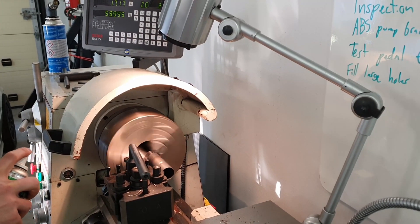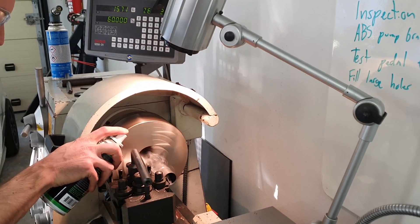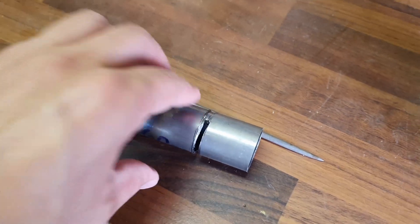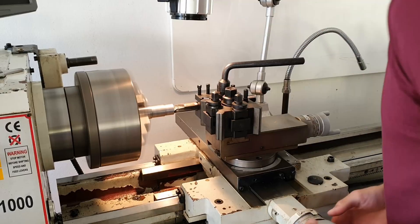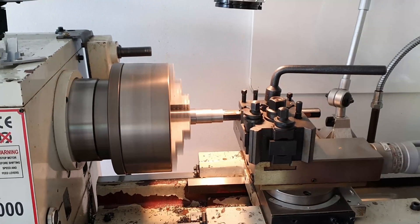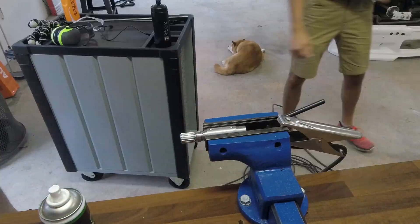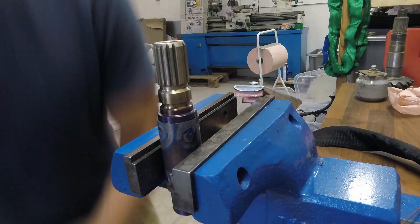After deciding the correct amount to lengthen the column, all that was left to do was to cut down the extension to 60 millimeters — which Mike messed up. So now we know we won't be using parting tools on this high strength steel tubing anymore. We remade the shaft extension, welded with both rosette welds and around the circumference of the tube.